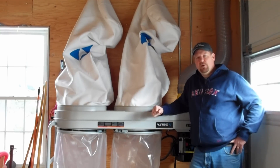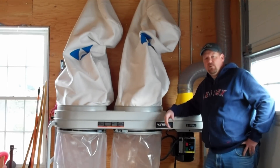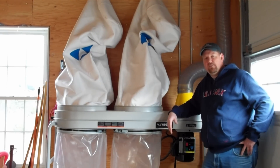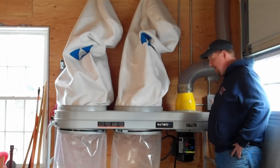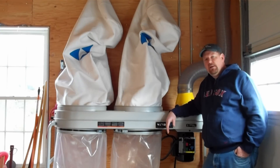I've done something a little custom that most people don't. Typically this thing can be turned on with the motor controller down here, but mine's not set up that way. The relay on that has been disconnected by a qualified electrician, and we've rewired it so that we use three- and four-way switches up in the shop so I can actually turn this on upstairs from any different workstation. If you're interested in that, I've got an article and video coming out about it — it's really neat and very inexpensive to do. I've also got it set up with a 220-volt line with a twist lock so I can disconnect it, wheel it around the shop, and clean up around it.